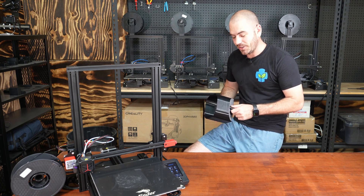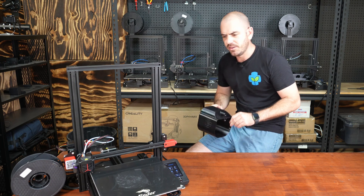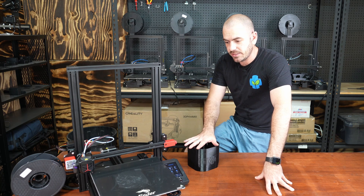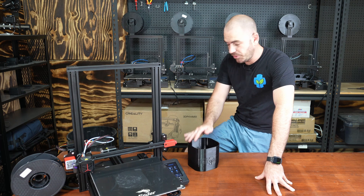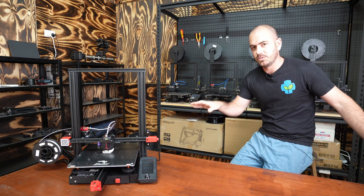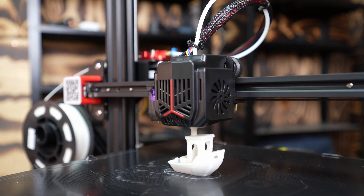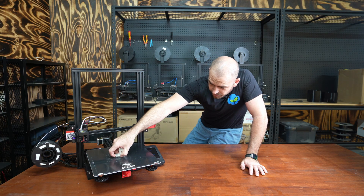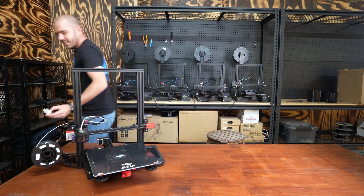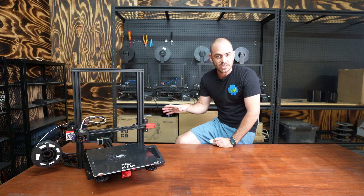So I broke the print — that didn't exactly go to plan. That's because I need to get used to using a glass build plate. The PETG and the sheer surface area of the print requires some kind of releasing agent, because that is a really adhesive build plate, and I need to get used to it after using magnetic build plates that peel away. So because I made such a mess of that last model, I printed a benchy to test the performance and show what it's capable of when used properly — and that is a lovely benchy. Not a bad benchy at all. This is a really nice offering from Creality.